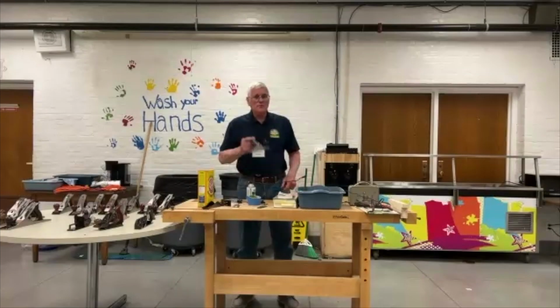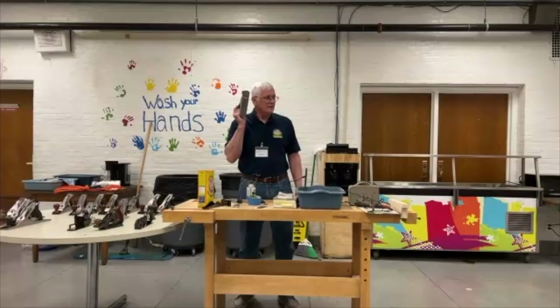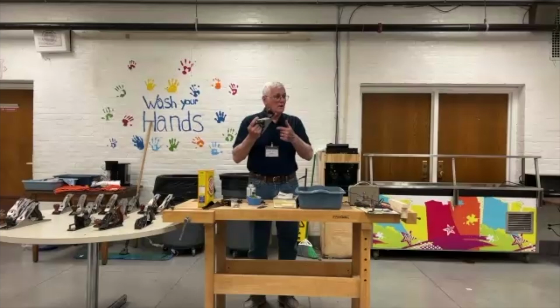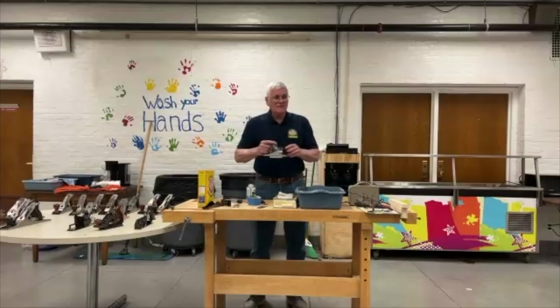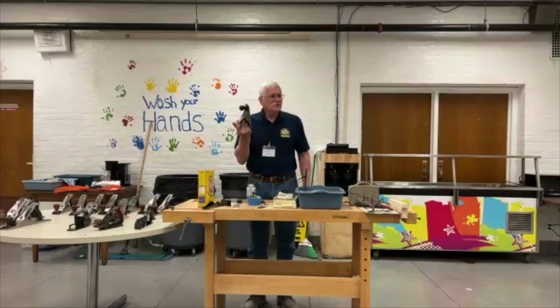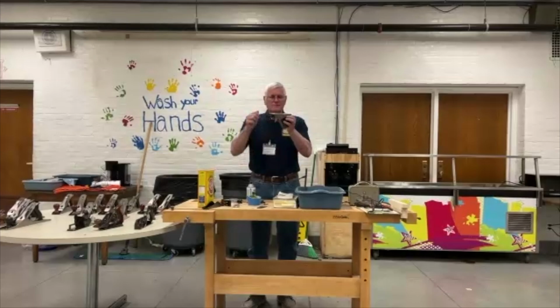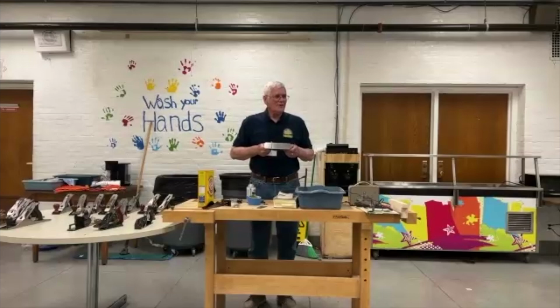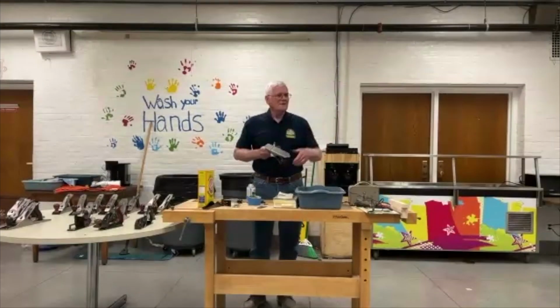And it'll be beautiful if you shine it high enough, like 1,000 grit at the very end. When you're down to using 1,000 grit, now you want to use your magic marker more. And you'll be surprised, it takes it off really quick. Once it's all gone, I would assume it's flat. Now you can measure it, you can put your level or rule or whatever you want on it. They're pretty darn flat.